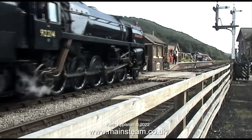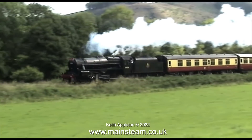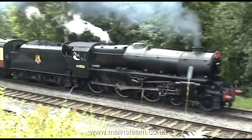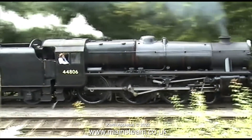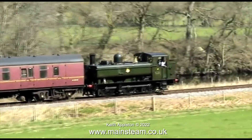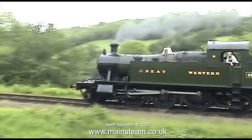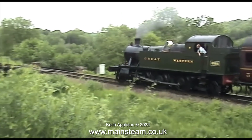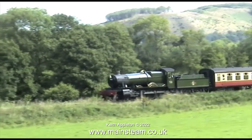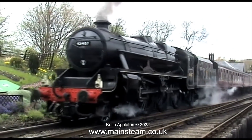Here you see a 9F 210 and this looks suspiciously like a Black 5 - here it is going the other way. The thing they have in common is the valve gear. These locomotives have Walschaerts valve gear. This small Great Western Railway pannier tank has Stephenson's link valve gear which is internal, and here's a Great Western Railway prairie tank whose valve gear is also inside the frames. The Great Western Railway engines were really good machines and led the way in design.